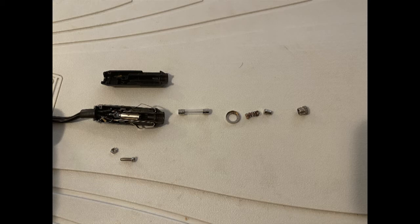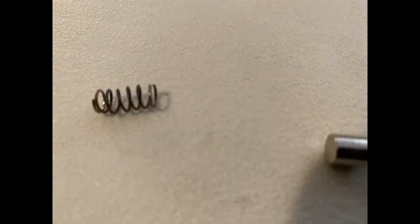I got to looking at the spring this time. The spring had kind of collapsed, so it wasn't really pushing the little button on the end of the plug out anymore. I went ahead and stretched it back out, put another fuse in, and it still got really hot — it almost seemed like the spring had started to act as a little heating coil.